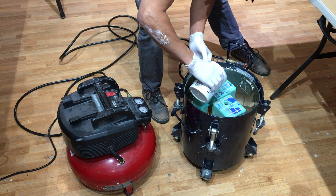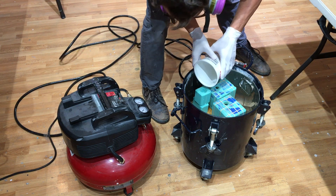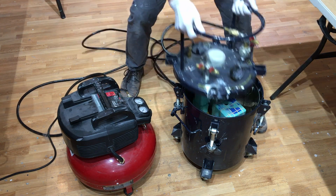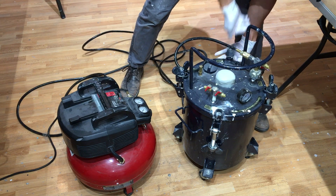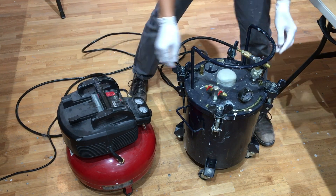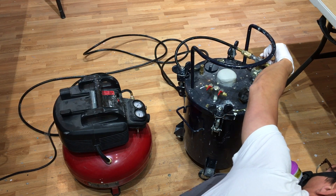There are a whole bunch of details, tips, and tricks to making this process work smoothly, but that'll have to wait for the deep dive video. If you have the right tools, the learning curve is not that steep. If you've been casting resin without this process, I guarantee that after you try it, you'll wonder why you didn't do it long ago. The amount of time you save on cleanup is just ridiculous. The amount of time it took me to get everything done here was a little less than two minutes. You don't really want to wait until that exact three-minute mark because it starts to thicken up before that time — two minutes is a good target. I still had one full minute before it kicked where the pressure could do its thing on the bubbles. Then I'll just leave the molds in there for about 10 minutes until they're fully cured.